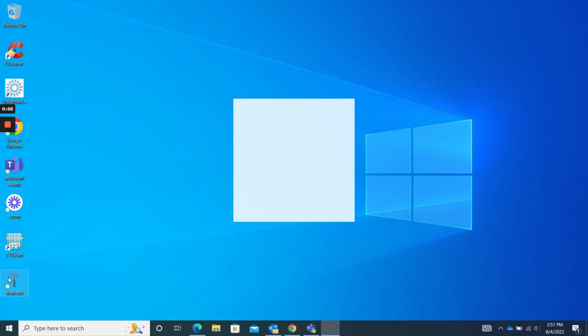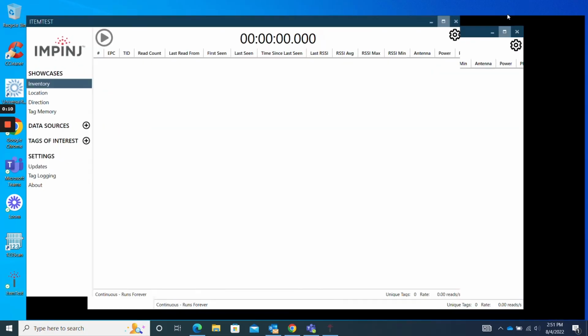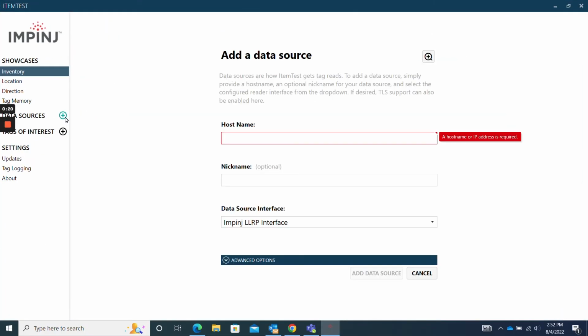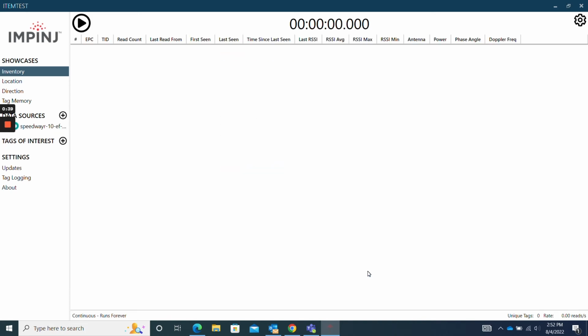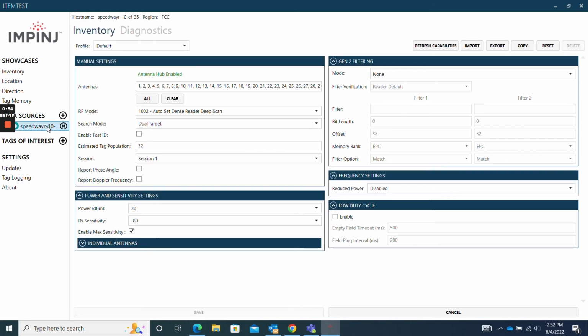ItemTest. Open ItemTest and connect to your reader by clicking on the plus sign next to Data Sources. Input your reader's hostname into the hostname box and then click Add Data Source. If you need more information on downloading, setting up, and using ItemTest, check out our video downloading, installing, and using ItemTest via the link on screen now, which is also available in the description below. Our reader has now been added, and when we click on the reader's hostname under Data Sources, we can see that ItemTest is aware that our Antenna Hub is enabled.